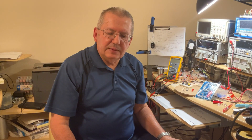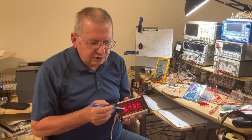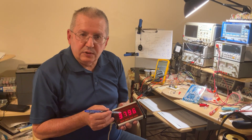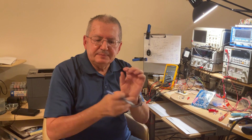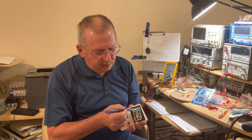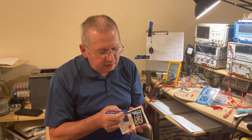Inside a small display like this one — only 0.8 inches or smaller, such as this 0.3-inch one — each horizontal or vertical segment only needs one LED behind it. The segment is actually built from resin and is used to spread the light evenly across the segment. But as displays become bigger, like this 2.3-inch one, a single LED is not enough to light the segment evenly — this is why each segment here has two LEDs.